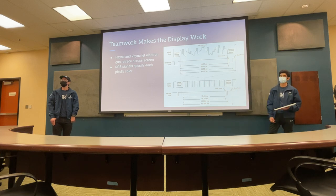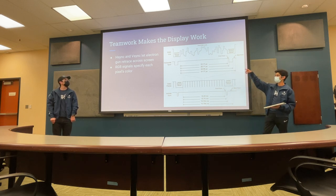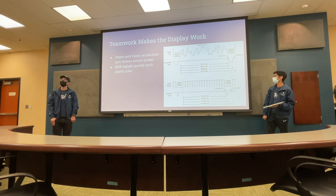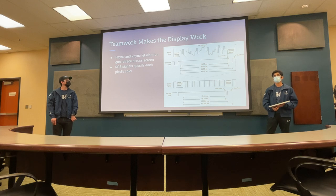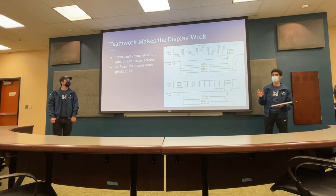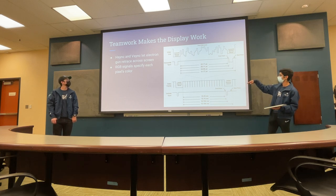This is kind of like a timing diagram of how the pulsing works. For every horizontal line, you go across and give the RGB signals — each pulse represents a different color for each pixel. There's this thing called a front porch and back porch: in that period, you need to zero out the gun voltage before retracing. The horizontal blanking interval is when the gun actually moves back across the screen, and in that period we don't want any voltage in the electron beam, because it would draw a random line across the screen. You zero out the voltage with the porches, sync back, and do the same thing for vertical.